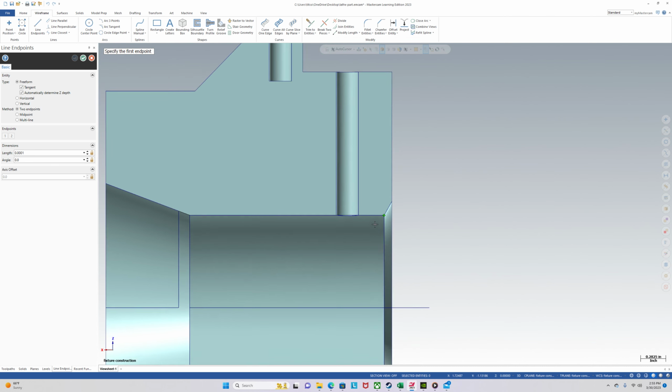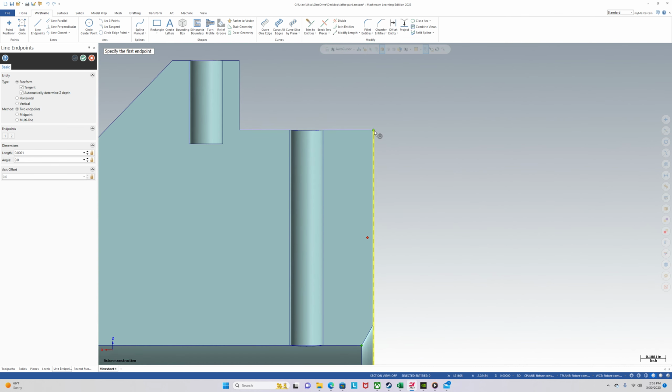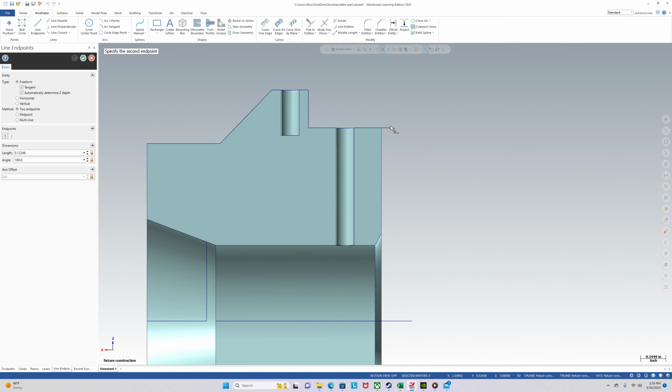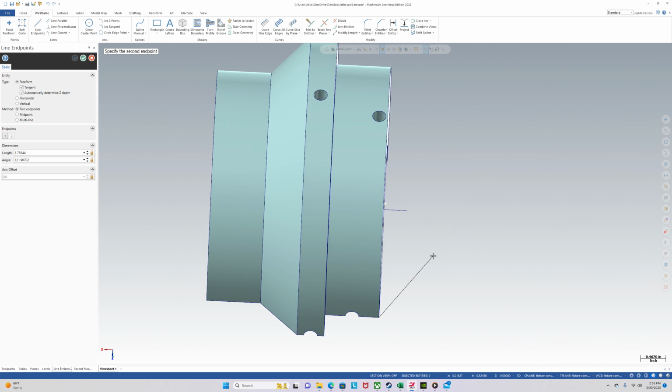We'll just keep that. And then we will have the fixture not stick past the part. No reason for that. And so we have to think, if we want to get a tool in right next to that hole right there, let's say we get like an ER16 in there.